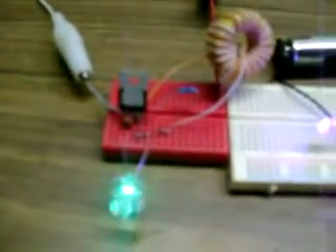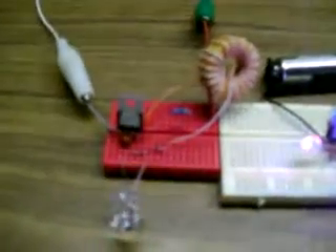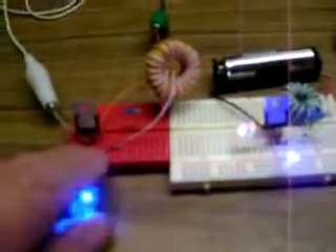You can actually read it — take the bulb out, put some pins in there, put your voltmeter on it, and it will give you a stable reading. It will give you some voltage drop. If you try to test it with the LED in there it will jump all over the place, but take your LED out and you will find that the current is stabilized with just two diodes and this capacitor.